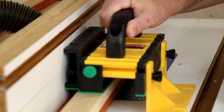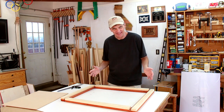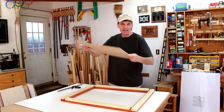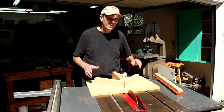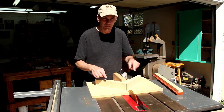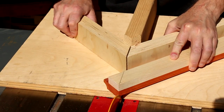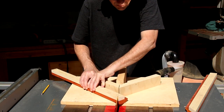As many frames as I've made over the years, I've never been able to develop some sort of a magic system that works perfectly every time. The only way I can do this is by slowly cutting the sides down bit by bit until I reach the exact size. I've cut a 16 by 20 board that I'm going to use to keep testing it so I don't actually have to use the art. The one thing that helps enormously is having a miter sled for my table saw — I've got a separate video on how to make this. It's a perfect 90-degree angle so I can run a frame through it and cut a 45-degree miter. The pieces that mate up I cut on opposite fences.